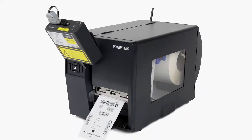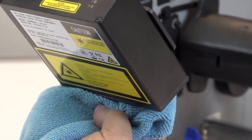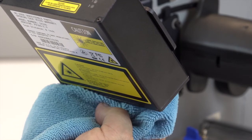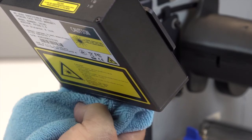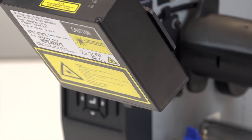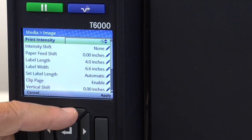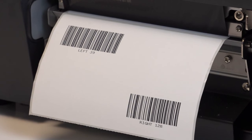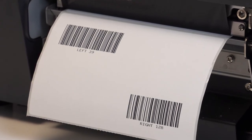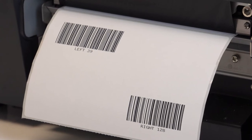Here are some hints to make sure your setup is performing at its best. Periodically clean the lens on the validator with household glass cleaner and a lint-free cloth to remove dirt or smudging that could distort barcode images during scanning. Adjust print intensity just enough to make sure there are no voids in the barcodes during printing. Always maintain an adequate quiet zone — the white space to the left and right of the barcode. About one half inch is desirable.